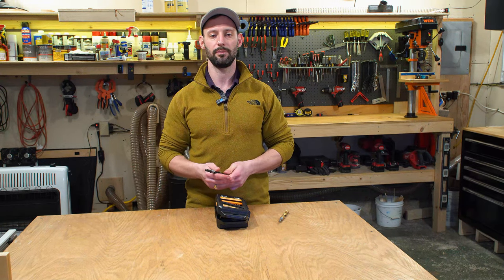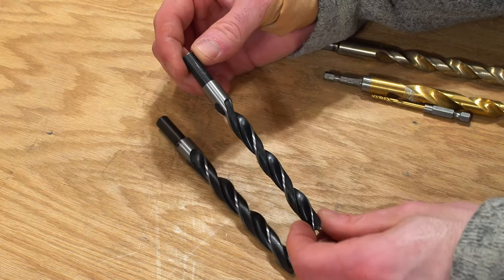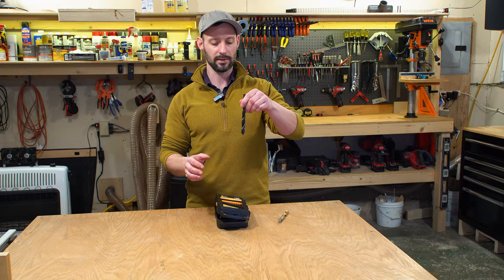Perhaps this was just a bad set. Obviously it's well known that Harbor Freight sells cheap tools. Another way to demonstrate the poor quality is the missing etched label of the 29/64ths bit — it's simply not there. The bottom line is these are bad drill bits. I would not recommend them in any way whatsoever. Spend your money on something else. I did order a nicer set of Fisch Brad Point drill bits that will be coming later this week, and if they're nice I'll do a video on those as well and maybe a comparison between the two. But one last thing I want to point out is the runout of this was over a quarter inch on the drill press — that's unusable. The second that this hits the wood oscillating back and forth, it's going to break the Brad Point right off the bit. It's going to destroy the piece of wood you're working on. It's baffling that this could be in a package and sold. It's dangerous.